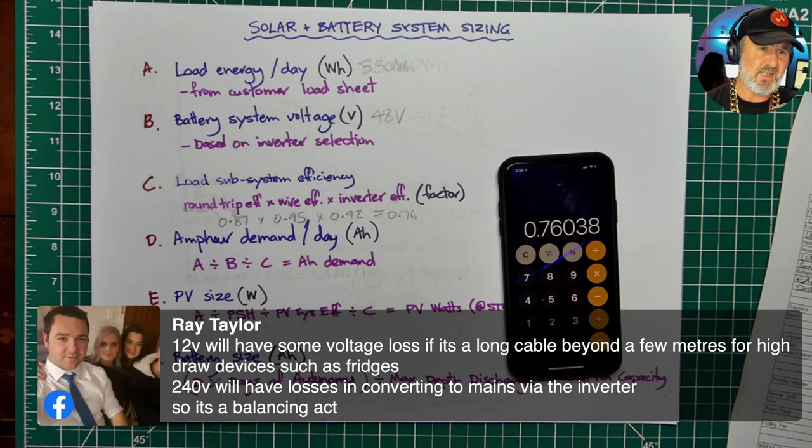But when you're talking a tiny house where it might only be 6 meters long, it's doable by selecting your cable sizes. I often say that voltage drop on a cable is a self-inflicted loss. You choose the cable, you choose the loss. Certainly when you do have high currents, like if you're drawing 100 amps to run an inverter at high power, that's a lot of current at 12 volts and a lot of loss. So you'd have very heavy cables and expensive cables. But for something small like LED lighting, not such a big deal. Okay, so thanks for that one, Ray. That's great.